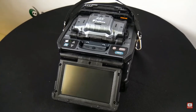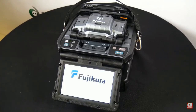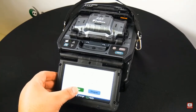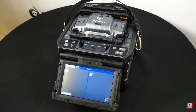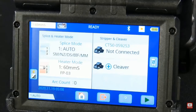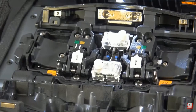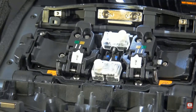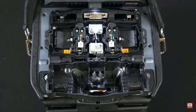As you can tell, there's a 5-inch touchscreen GUI. One thing that's nice about this splicer is that if you are splicing loose buffer fiber, there's no need to purchase and swap out an additional sheath clamp. A universal sheath clamp that handles both loose and tight buffered fiber is standard.